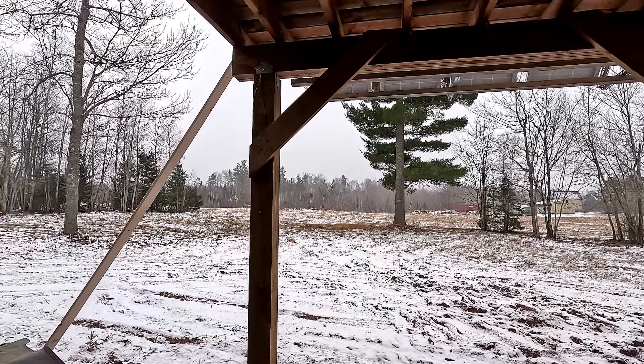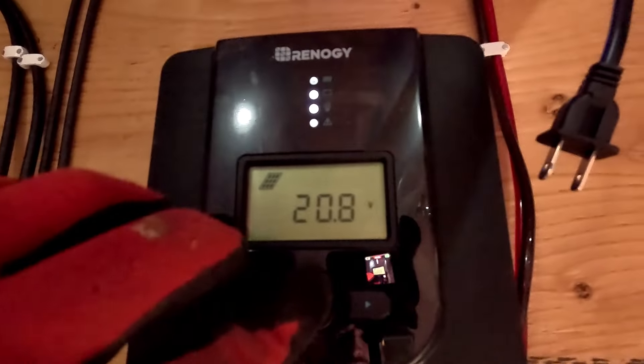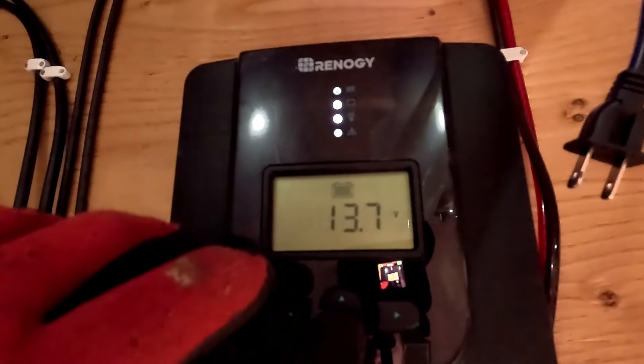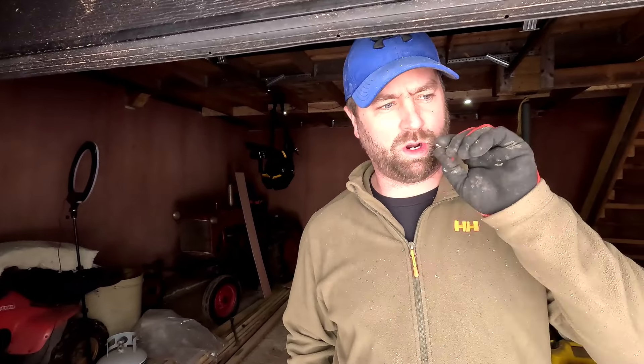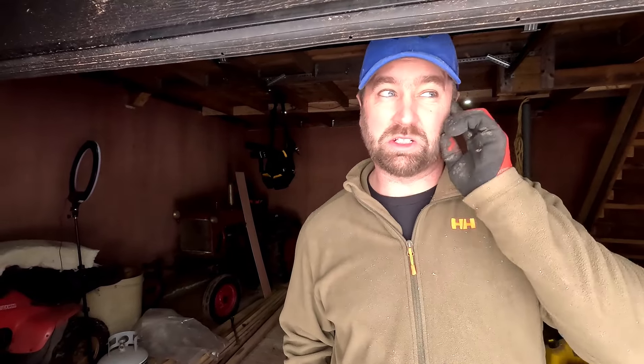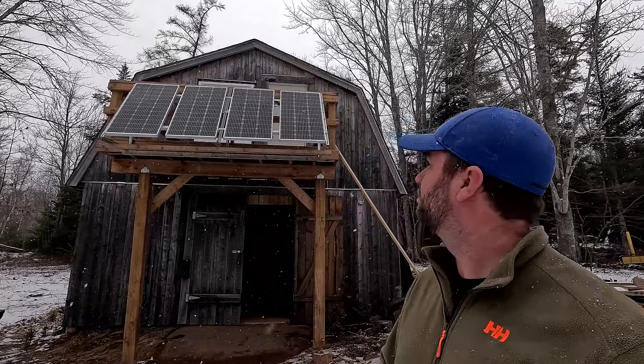As you can see, today it is cloudy and it's even snowing. But if you come in here in the dark with me and have a look, the solar panel is actually generating 20.9 volts still, so we're still charging. Even though it's snowing out, the batteries are at 100% despite the fact that I've had the radio on and the lights on all day. Whenever you consider whether or not you're putting lights in, I would recommend if you can go with a full 12-volt system for your lighting — that's the way to do it. You can put 12-volt dimmers on and stuff like that. The 12-volt lighting is one of the biggest aspects of changing from 110 to 12. The solar panels — they're exposed but they're not really getting any sun. It's a pretty pale day.